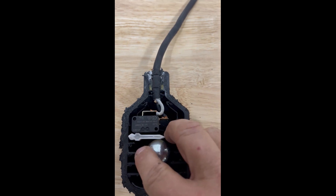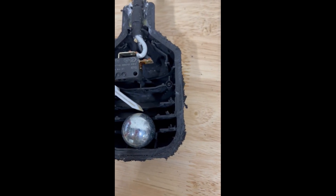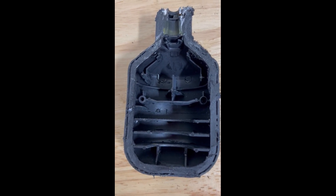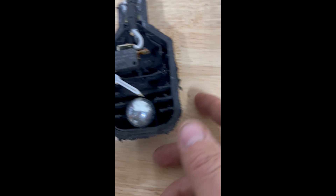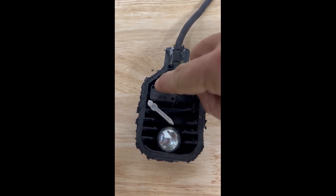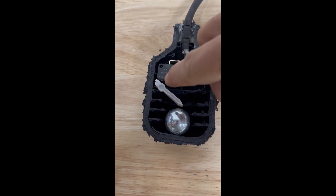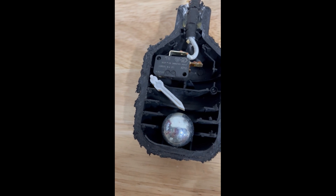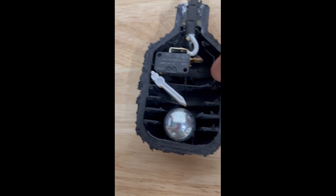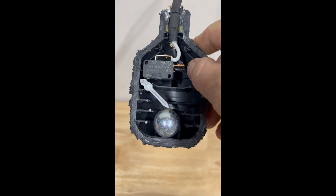So in this float, what has happened is you can see there's some moisture still in it — still some moisture in this cap. When I got it cut open, some water came pouring out of it. Moisture has gotten into this switch right here, and where that little button is, there's a little metal spring, and that spring has rusted and is no longer pushing the button out.